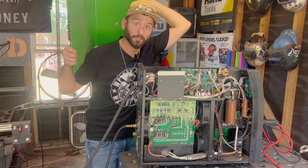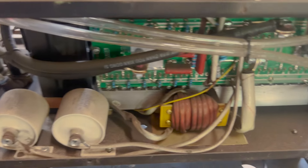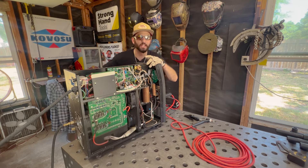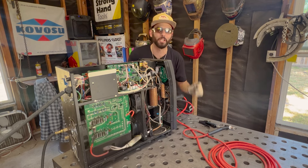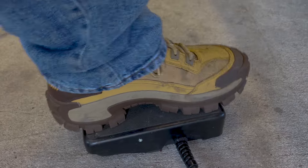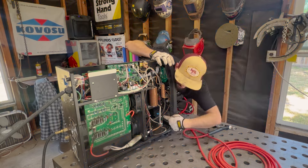So we've got to find this high frequency board inside all of this stuff. It's not a bad idea to blow out the welding machine while it's on so the fans are running and blowing all that gunk out. Now before you start poking around inside, be sure to power the thing off. What I do is leave the machine on — don't touch anything — but hit the remote and you can hear it. We'll trace it down that way. You'll even see a little lightning bolt, and it's right down yonder.